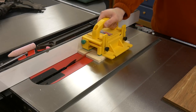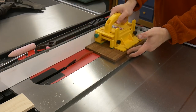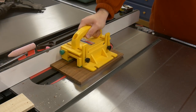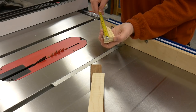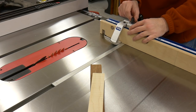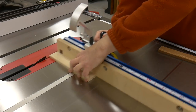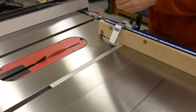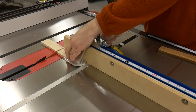With the pieces at the final thickness, I can now go over to the table saw and cut them to the final width. I already had a plywood template made, so I'm measuring the length and setting my miter gauge to that length, which I believe is 4 inches, and then cutting the pieces to the final length. Any time I cut pieces like this, I like to start by truing up the end before placing it up against the stop block.